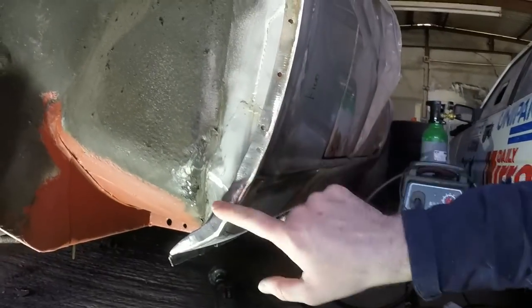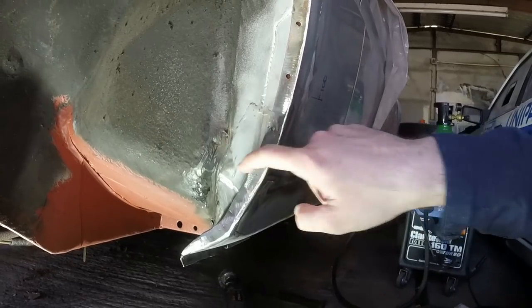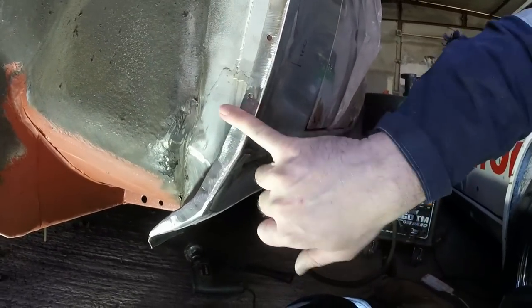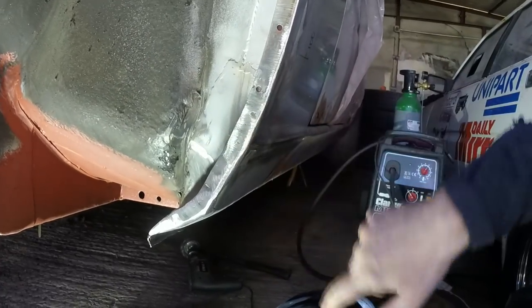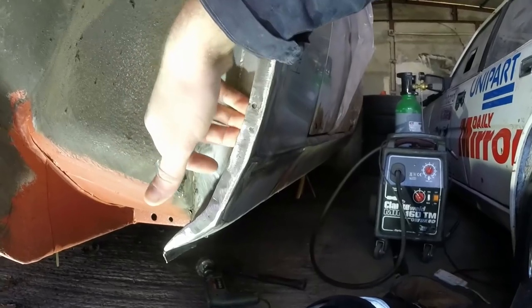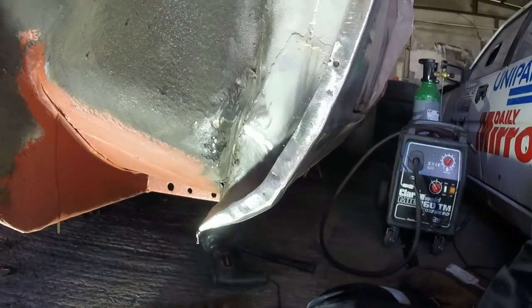Essentially, all I did was put a piece in there and I made it as a tab with a little wing extension, which basically is another technique you can use for welding close to the edge of something without burning back. People have mentioned copper, and that would have been one of those situations ideal for copper because it would have stopped heat spread and stuff like that.